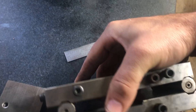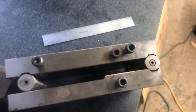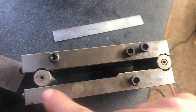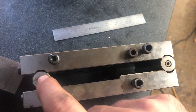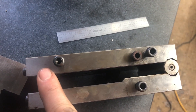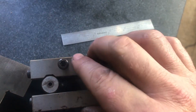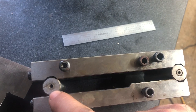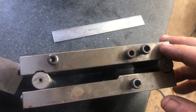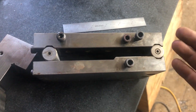The reason I don't like this style is these two pins — these are five inches on center and they do agree, so this is a pretty spot-on sine plate. But if these two pins are short, you've got to grind that right there. Well, now it doesn't rest on this side anymore, so you've got to grind up to where you need it on this side to match. Then this side has to be ground up too. Now when you're flat, this side's low so you've got a negative angle — and you've got to come in and grind this up. That's a lot of work. If I didn't agree with this and had to reset it, it would take me an hour.